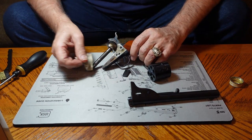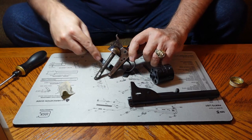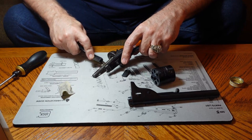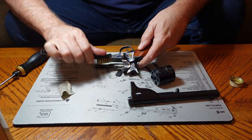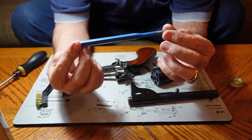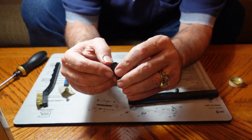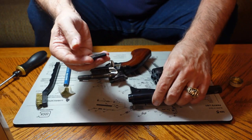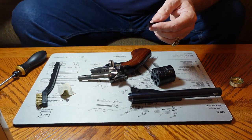Some of this stuff does not come out all that easily and you may have to brush it a little, particularly in places with a lot of fine grooves. When you take this gun apart and pull that pin out, don't use a steel drift. Use something plastic or bronze — something soft — because you can actually damage the end of the pin and mushroom it out. If you do that, you won't be able to get it back through the barrel to hold the gun together. So be careful not to damage the pin by whacking it with a hard hammer or hard drift.